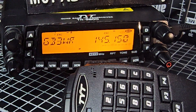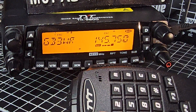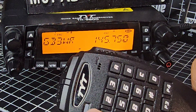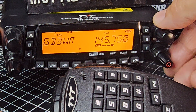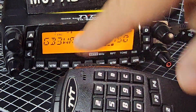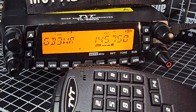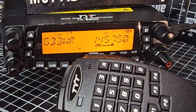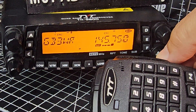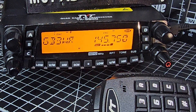Cheers, 73. And then on the top here you've got some buttons - up and down on the top, you've got the LED there that comes on green and red. It's not going green when I receive - let me just turn down the squelch. It's just red at the moment when I transmit. Working well, no problem with that. So just overall, the basics are: if you want to just type in a frequency you can just press VFO and type it in.